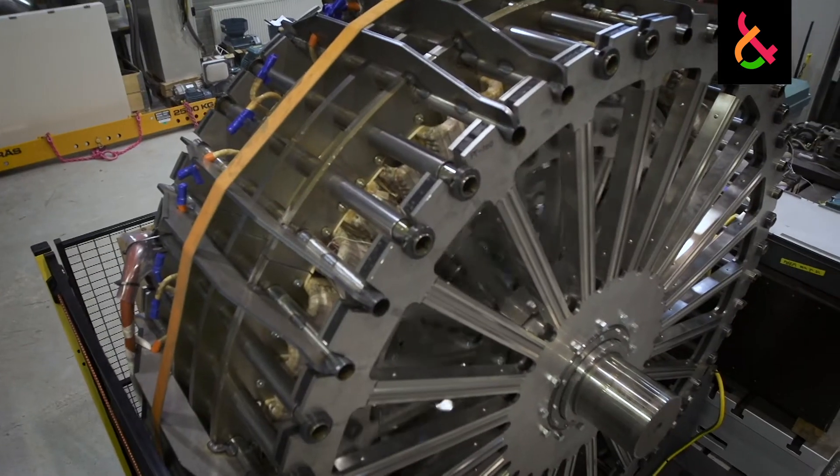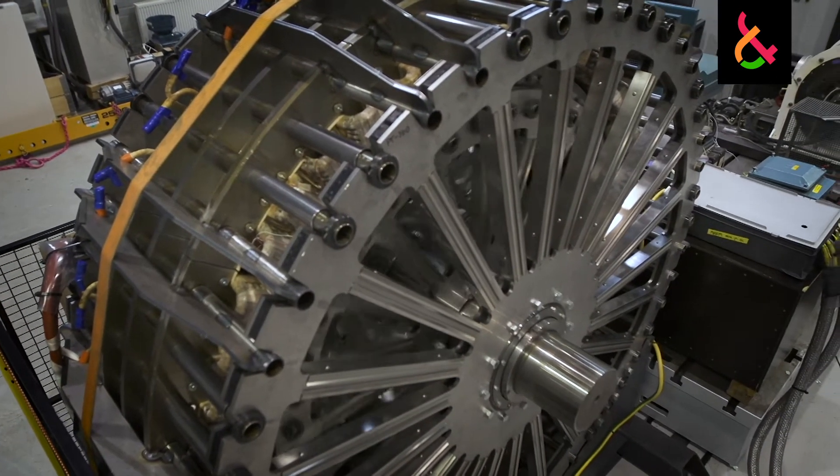You've got a magnetic field in the stator and a magnetic field in the rotor, and the moving magnetic field in the stator is turning the rotor, so the rotor is following that field.